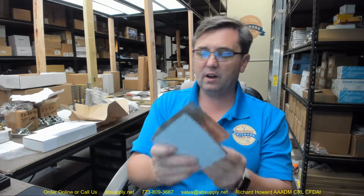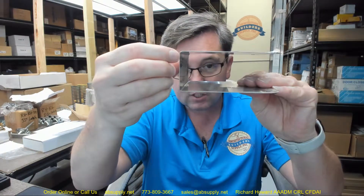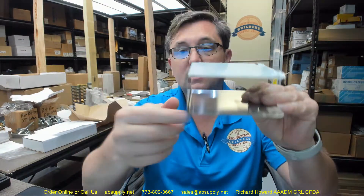You're not going to bend this unnaturally or damage it. You don't want it too thick because material that's too thick means that bend on the plate is going to be awfully difficult to get installed onto a door. There's a link below this video to the template, which shows you the dimensional properties of the item. It also mentions the other finishes available: PB for polished brass, AB for antique brass, BZ for satin bronze — that would be 605, 609, and 612 finish.